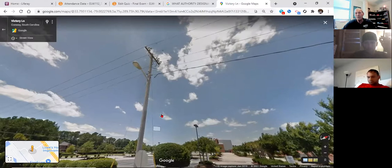All right, so what we have here is our three phases of conductor, and whoever did this underground installation right here, George, if you can mute yourself, did a process called phasing. So they phased the overhead conductors. They knew which one would be A, B, or C. Now, like we said before, on our overhead conductors here, just by looking at them, we can't tell, and they might be in a different configuration. This might be C, this might be B, this might be A, or any combination of the three letters.